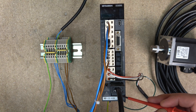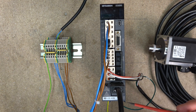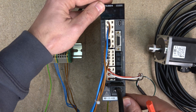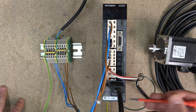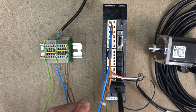This battery plug is quite crucial if you're using absolute encoders. Do make sure, if you're using an absolute encoder and doing the setup within FX Configurator - which is in upcoming videos - it's very crucial to make sure you select incremental or absolute encoder. If you select absolute encoder it will be throwing all sorts of errors saying the encoder is not right and the battery is not seen. Every time you see your system has a battery on it, it is very likely that you are using an absolute encoder. Absolute encoders are really good, but again that's not the subject of today.